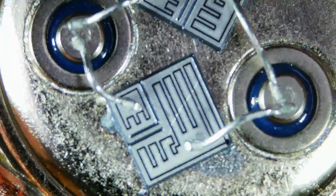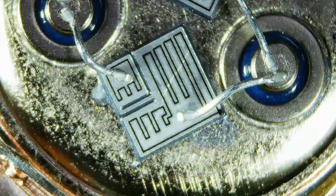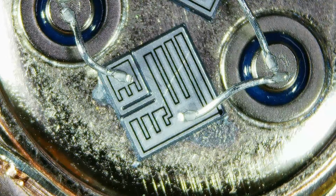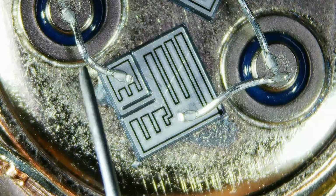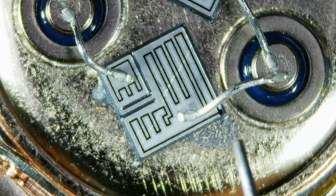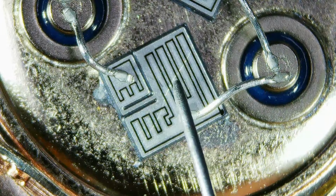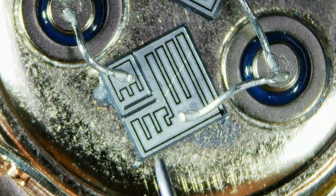This is the emitter base. Okay. Well, maybe I can't. But oh, yes, I can. Okay. So if you look at these devices very closely, you can see that this is one transistor here on this little chip. Remember, this is a super small piece of solder. And this is a much larger area. It's connected to the surface of this device, which means that's the collector. And so this is probably the emitter here, and this is the base, the small area right here.